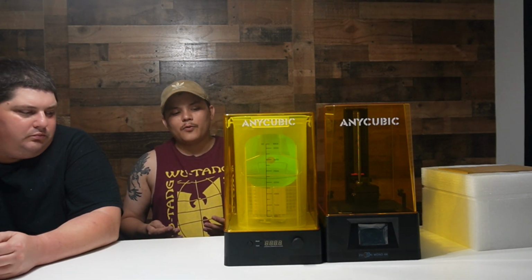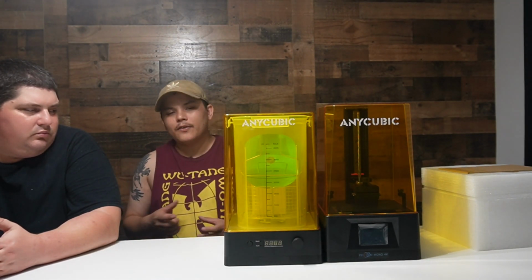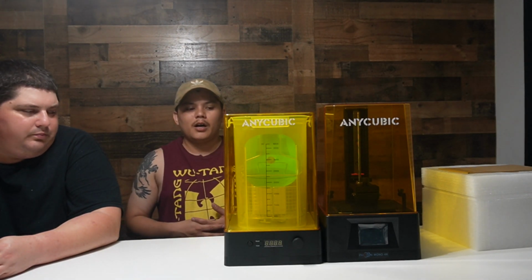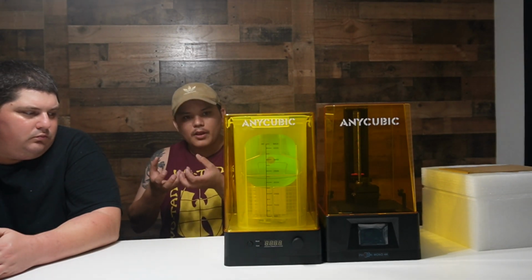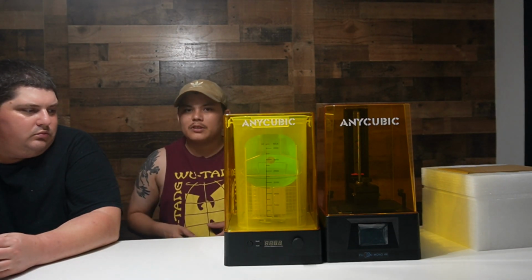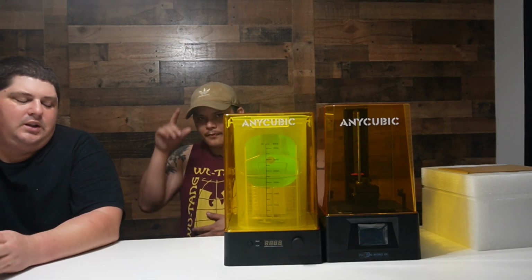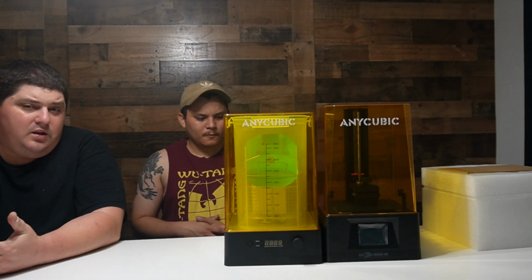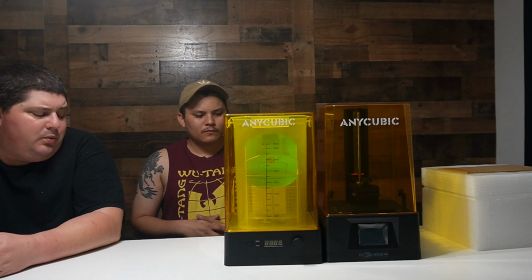And the beauty is, for the most part, after a print, you can use that filter you have and pour it back into the bottle. Most of it is reusable. The defects and excess pieces are going to float to the top, and you can skim them off. Or if you pour it into the filter, it'll just catch them all. And you can go to any paint store and get those filters. They're the same filters you use for an HVLP spray gun.